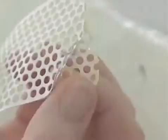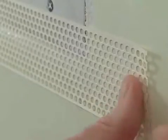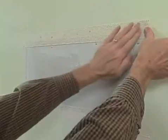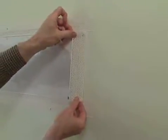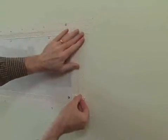Use an adhesive back wallboard seam tape. Peel the backing off the tape and apply it to the length of the seam. Press down an equal length over the seam along the top of the patch. Measure and cut smaller lengths of seam tape for the sides. Cut them so that they just touch, but do not overlap the layers of tape.